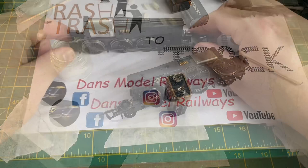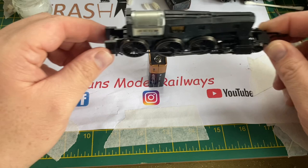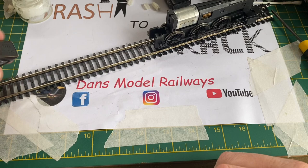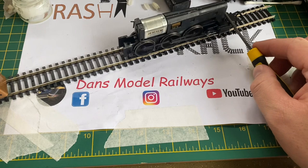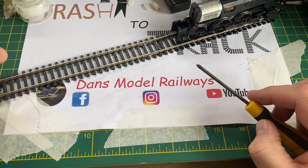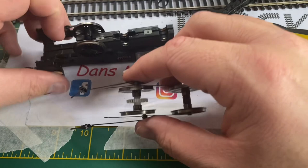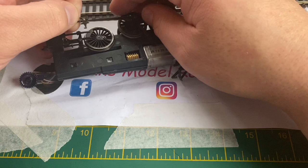It is running here but not very satisfactorily — it is very lumpy still. I'm going to replace that 3D printed cog with the original white one once I've prepared it. The loco is running on the test track but as you can see it's quite lumpy, and it was all down to that 3D printed cog — it's only about a millimeter too small but that's enough to make the worm gear not run properly and it will eventually wear out the gear teeth. So I have glued the axles in place on the middle wheel using the original gear wheel, and it runs a lot smoother.